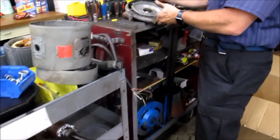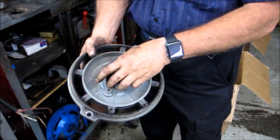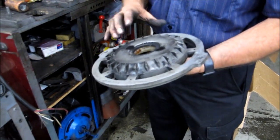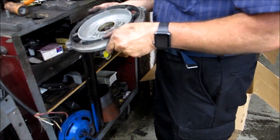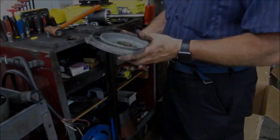On a horse-and-a-half you'll see these two holes here. On older models there were bolts that went through and another cover held this on; as they got newer they didn't have them. So you may or may not have two bolts to remove before you can take the rest of the way apart. At this point it's a matter of getting everything cleaned up, painted, installing a new motor shaft, rotor, and bearings, and then ready to go back together. And that's it.